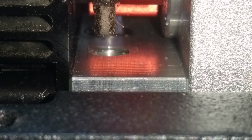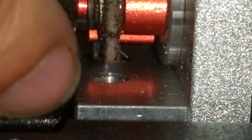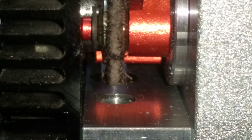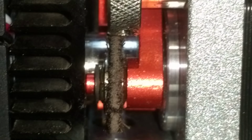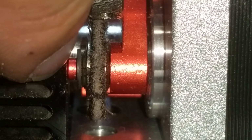I think I figured it out. It looks like it's solidly on there. But before, I had to loosen this screw a little bit because I thought that was binding a little bit. So I made the hole in the center there wider. And I also bored out this hole a little bit so the screw could move back and forth a tiny bit, because I thought maybe this whole thing was twisting when I tightened it down. And that may have caused it to bind. So that might be a problem you need to fix.